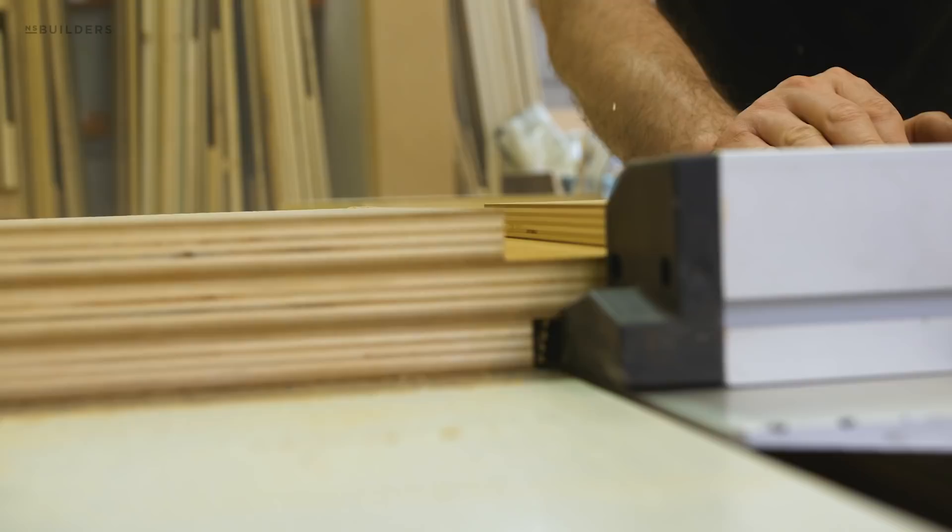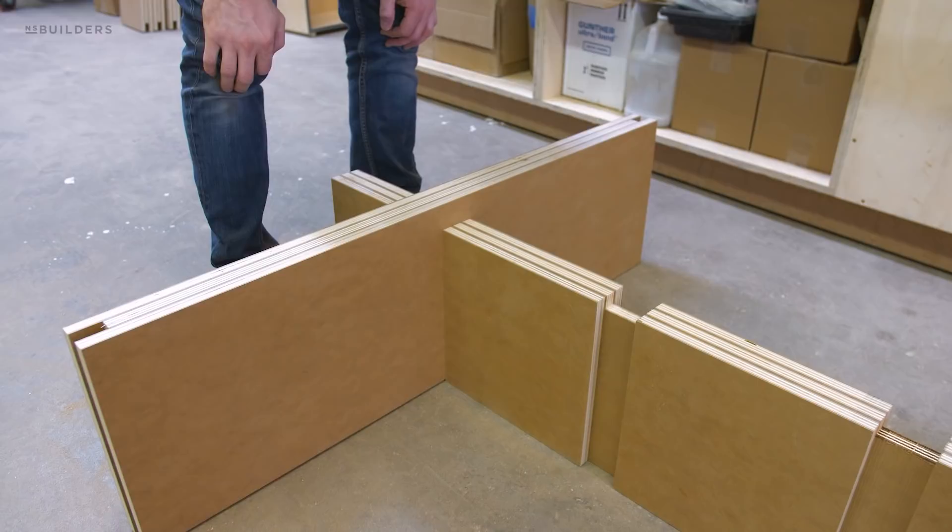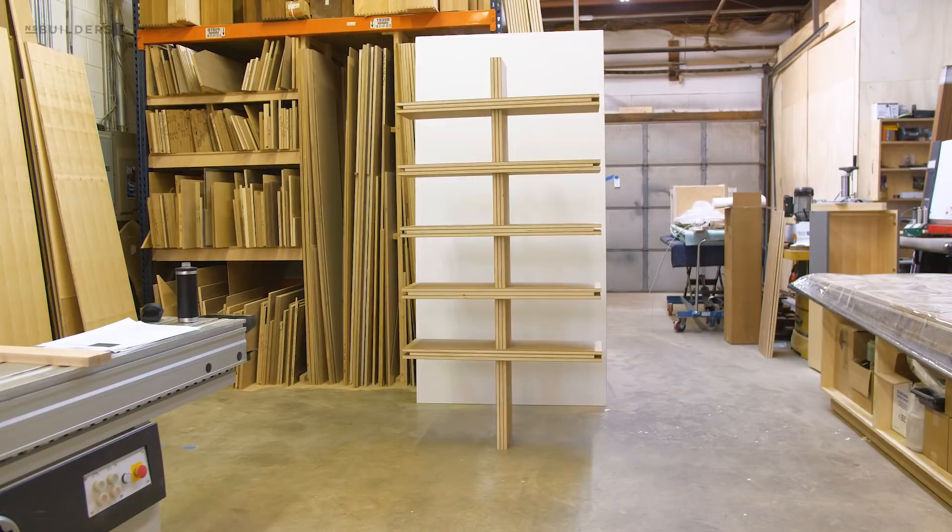Think of one piece being cut halfway through and a second piece also cut halfway through but on the mirroring sides. This allows those two pieces to slip together. Because we're dealing with something that was two and a quarter — and we'll get to that in a second — this allows them to slide seamlessly together. To keep that structural integrity with all of that weight posted down onto something solid, we couldn't just leave these joints fully open like you may in some other furniture designs.